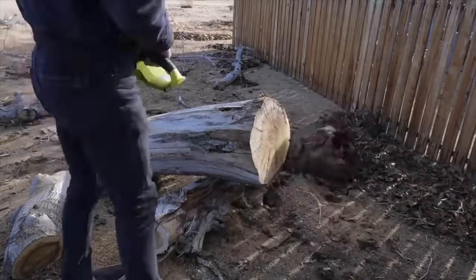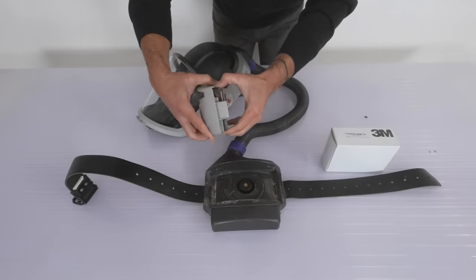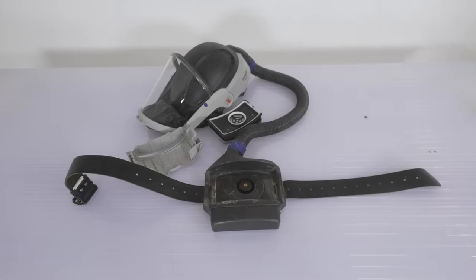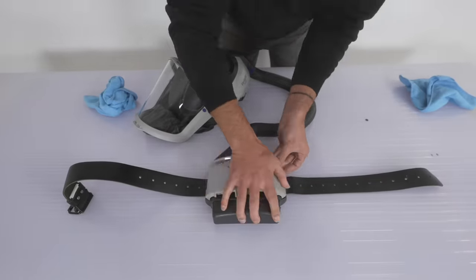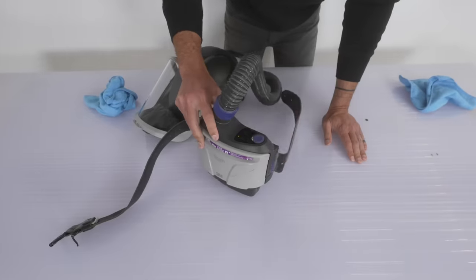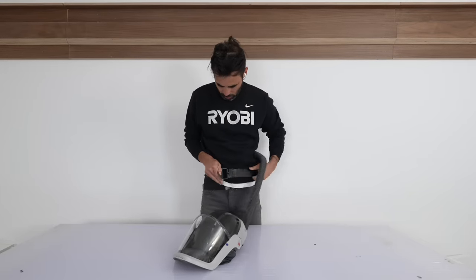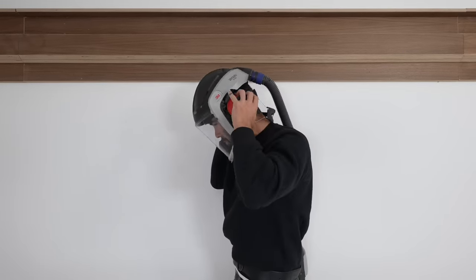Working with free materials is great, but one thing that wasn't free was my 3M Versaflow Powered Air Purifying Respirator Kit — definitely not a sponsor. I bought mine off Amazon, and for me the cost is mostly justified just by how comfortable it is compared to other masks. The filter and fans are on the belt attachment where you plug the battery in, and then that goes to a hose to the helmet where air is circulated around, which keeps the mask from fogging up. It works pretty great, and the only thing I don't like is that the helmet design makes it really awkward to wear over-the-ear hearing protection. I'm most often using this when I'm grinding or sanding, and that's also pretty noisy, so integrated hearing protection would be a nice addition.